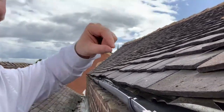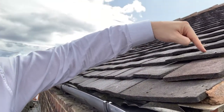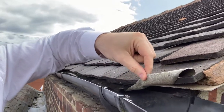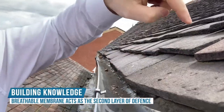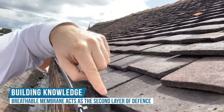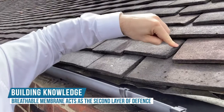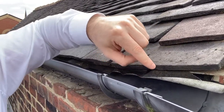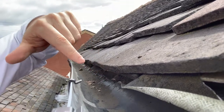We know it's had a new roof because you can see this here — this is the felt, the breathable felt. How this works is you've got strips of wood holding each row of tiles, and underneath this you've got this membrane. When water falls between the tiles, it's the membrane that does the work because it's waterproof. Anything that falls through these cracks — any water that gets underneath the tiles — that's the second layer of defence, and it runs into the gutter. So you've got tiles and then the felt underneath, and that runs into the gutter, which is how it should be.